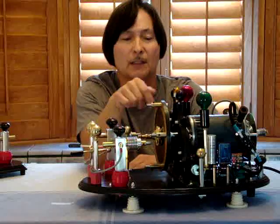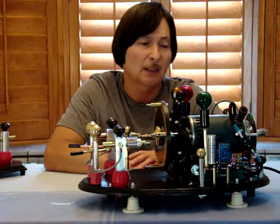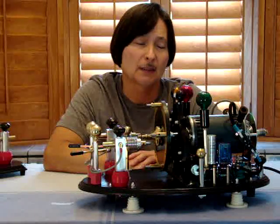I made a collar here so this wheel is adaptable to the shaft of the motor, and it works out very well. This particular motor is a regular synchronous motor that was converted and modified over to salient pole synchronous.